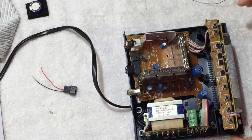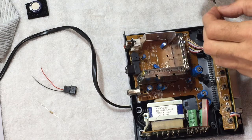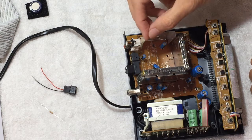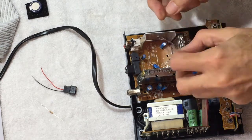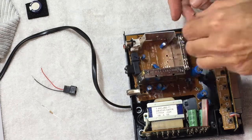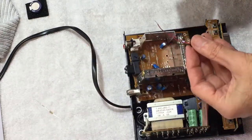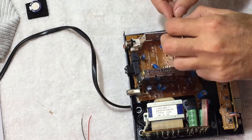Hopefully that's a better camera angle. What I need to do is connect my diode across capacitor C302. We're going to put the striped end to the positive side of this capacitor on this wire, and then loop the negative on the ground here and leave those leads there so that I can hook up the fan connector to those. Let me do that now.